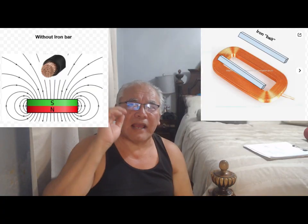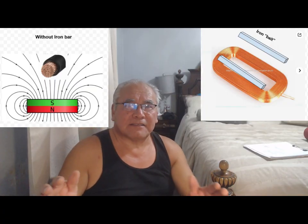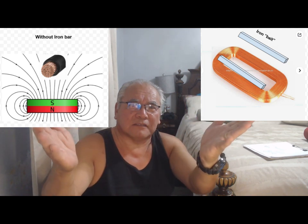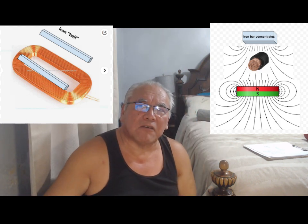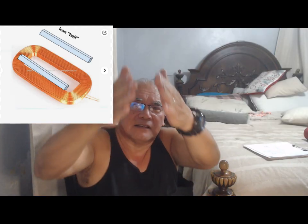When you add the iron bar, instead of the lines of force fanning out, they're going to fan inwards towards your iron. In between the iron and your magnet you have your coils, so it concentrates all this magnetic energy through your coils and onto the metal iron bar above. You want to make your iron bar the same width as your coils — that's how you concentrate these lines along that path.